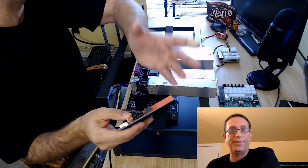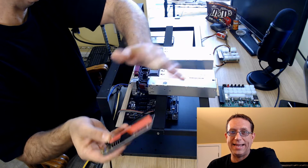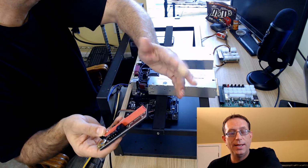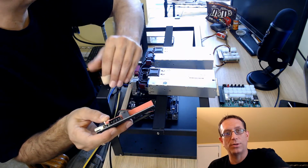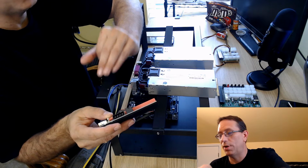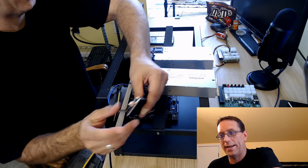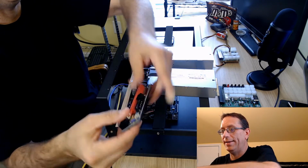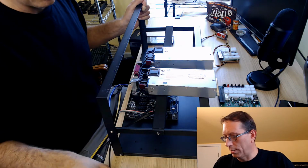Then if you talk about the SATA, you run into the same situation. SATA can't carry enough power to power a riser properly. If the card demands more, the riser will not be able to perform. So SATA is also not the correct way. The correct way is to go from your 6-pin right there and get in with that one. So we're going to look at that.